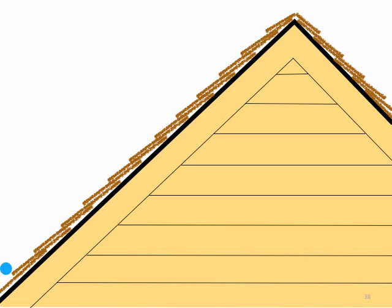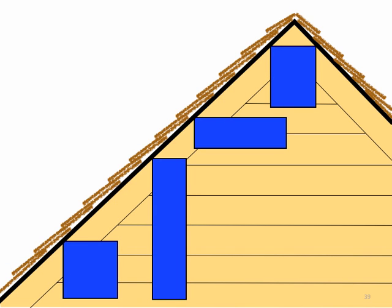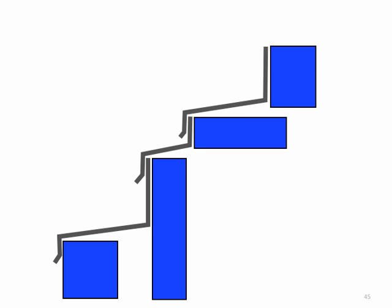Let's get a little abstract, since we're not dealing with shingles but with flashing. Imagine these four shapes: how are we going to get water from the top down to the bottom left without it falling in between the cracks and into the building cavity? We're going to install flashing shingle fashion — starting from the bottom, working our way up, and making sure each piece of flashing laps over the next. Now when water is dropped at the top, just like on shingles, the water is always staying on the surface of the building and down to the ground.